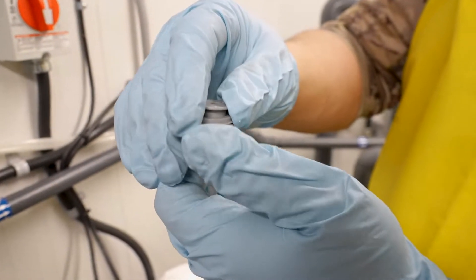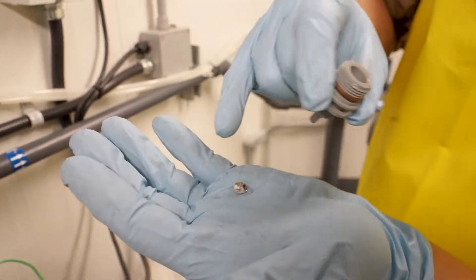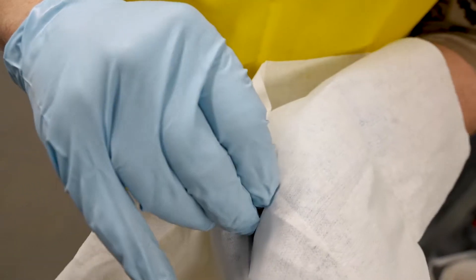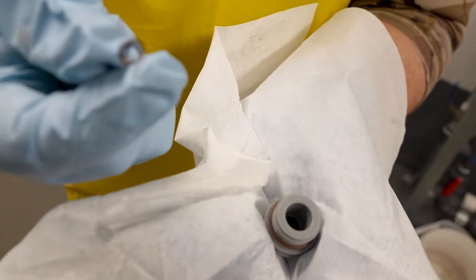Slide this out and watch out — there's a spring in there. The spring stays inside and inside here is a little ball. We clean this ball off, inspecting for any chips, cracks, or deformations that may prevent it from sealing. The black residue may not come off as it's minerals from the stainless steel spring. You also want to make sure that the spring isn't corroded through or broken.